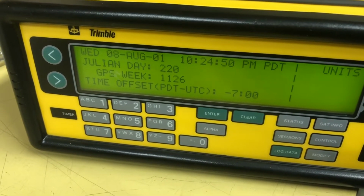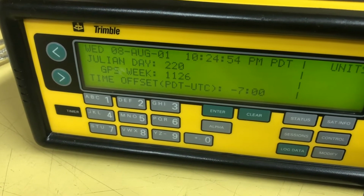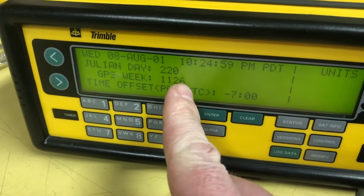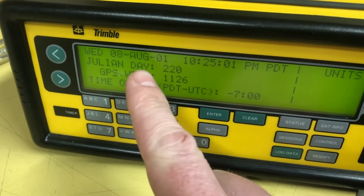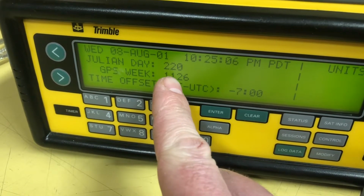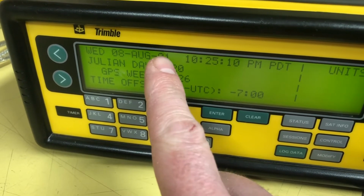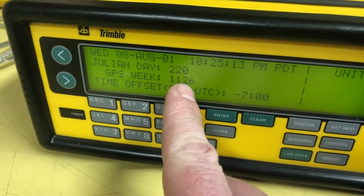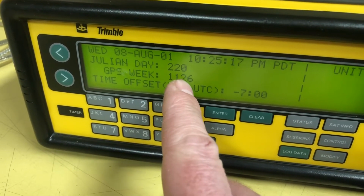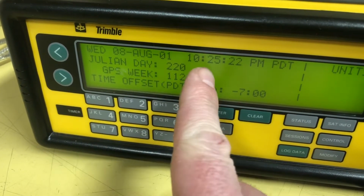The problem with doing that is in April of 2019, the weeks rolled over again. And so this is back to thinking it's the 1999 week rollover, which is why it thinks it's 2001, even though we're 102 weeks, so 2 years ahead. Yeah, 01, 2, yeah, that's right. So 99 plus 2 years gets us, which is 104 weeks or so. Anyway, the firmware doesn't understand that.